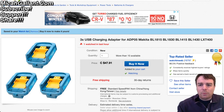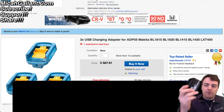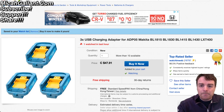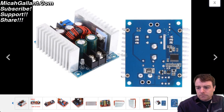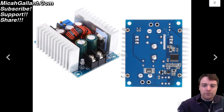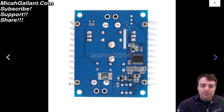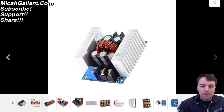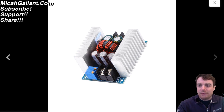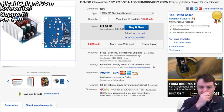These are the adapters that I would wire together in parallel, so that I have 18 volts, and you just multiply the amp hours there. And then you can get a DC to DC converter. So the question is, how do you get 18 volts down to a usable 12 volts? Well, what is really cool is you can get these step-down converters, and this is a 20 amp unit, and this will step down any voltage. You can input any voltage, and there's potentiometers on it, the little blue boxes in the corner, so you can dial down what voltage you want to get out of it.